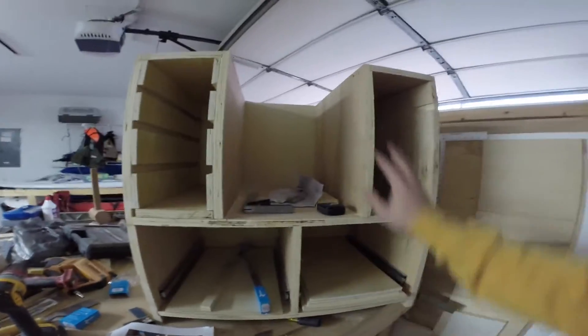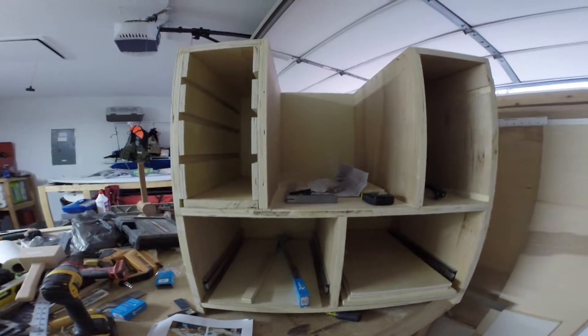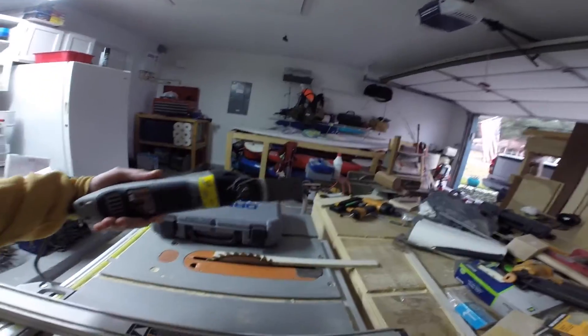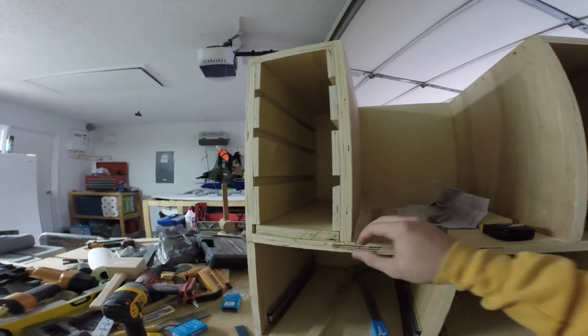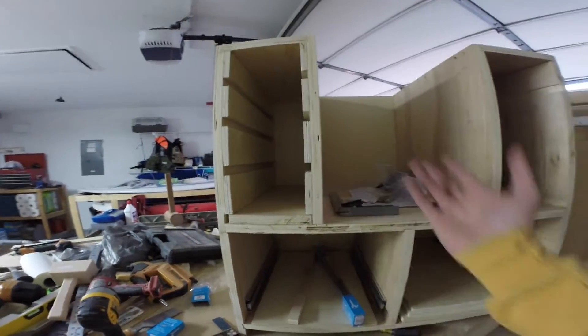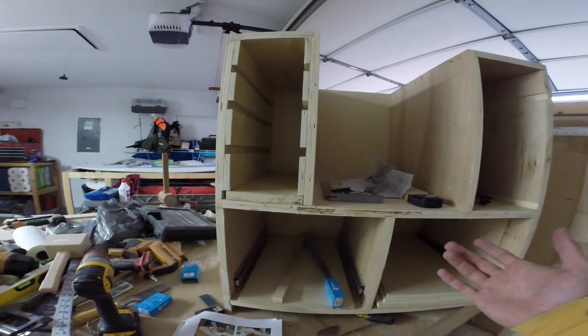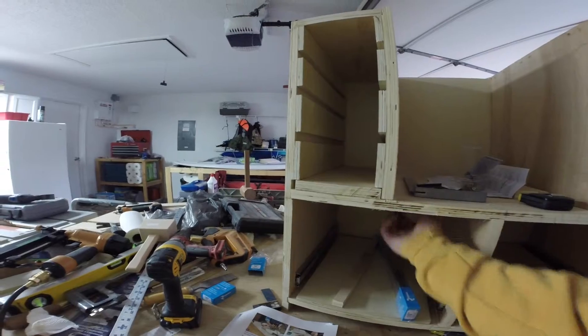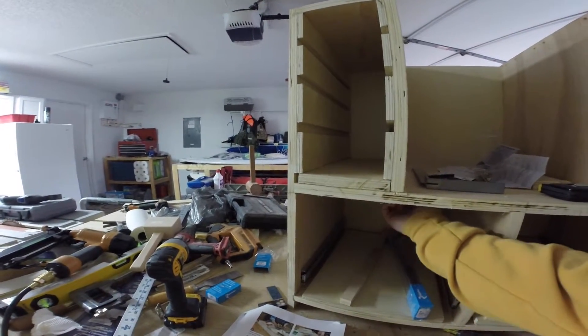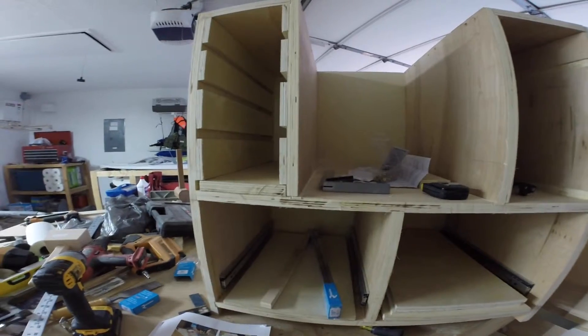By the time I realized what had happened, it happened on both pieces, and I couldn't just take it apart and fix it. So what I ended up doing is I took a Dremel multi-max — which is this thing right here — and just cut through this three-quarter inch piece so I didn't have to take everything apart and mess with the dado down here. So I just cut through it. It was kind of a pain, but not too big of a deal. I had wood screws in the bottom holding it together along with glue, and there were some brads that I had nailed — obviously I couldn't take out the brads — so the multi-max cut right through it. It kind of messed up the blade, but it worked.